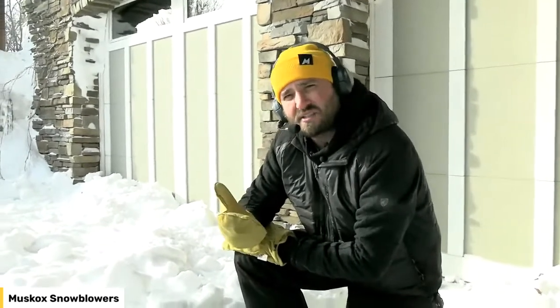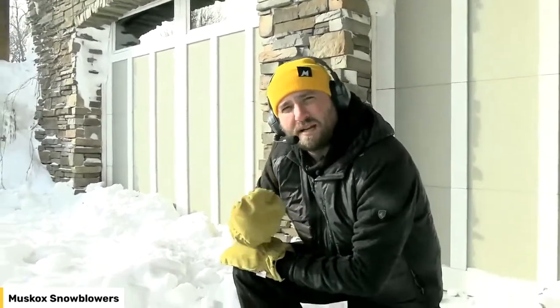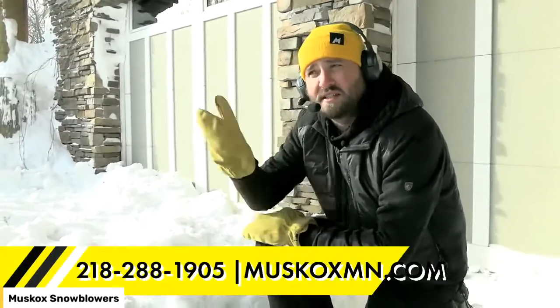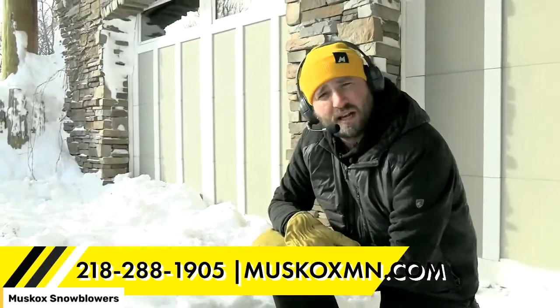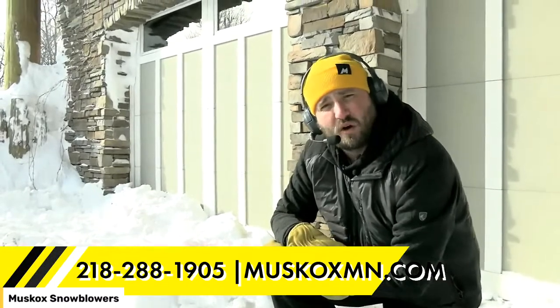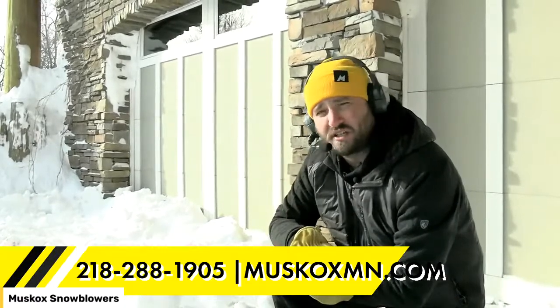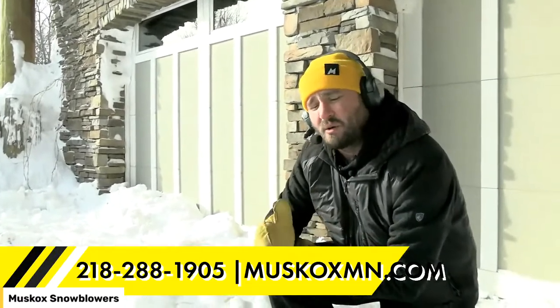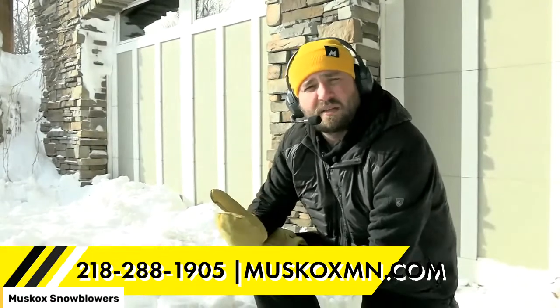When we operate that machine, it works on low, standard or high flow. We actually customize the MUSKOX for you, the operator. You work with us, and we get the right motor size for your skid steer. Today, we're operating a machine that gives us a high flow option, but we are able to work on standard flow machines and even low flow machines, and we'll work alongside you with that. And I want to touch on that quick. We're running a John Deere today, a fantastic machine, but we also have customers that have Kubotas, ASVs, Bobcats, Bobcat Toolcats. Any brand of skid steer we do work with currently.